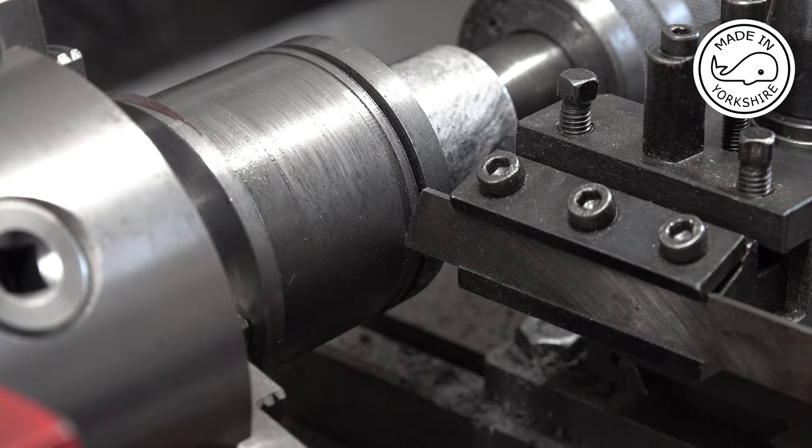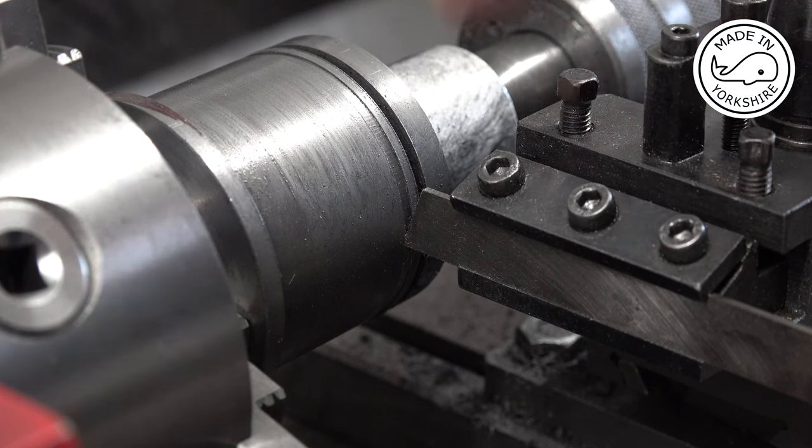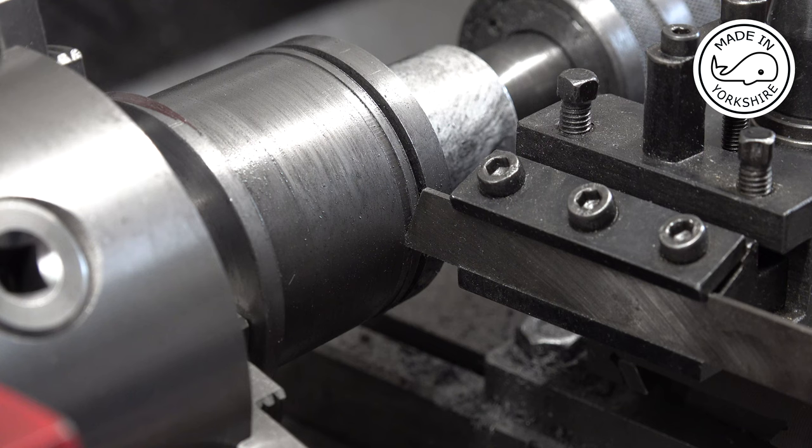I must say I'm struggling here cutting these grooves. I didn't have this problem when I machined the Howell cylinders, and I've sharpened the parting tool, I've honed it, I've got it on centre, and I've never tried this method before now. I've turned the parting tool upside down and I'm running the machine in reverse, but I'm still getting quite a bit of vibration.